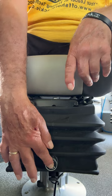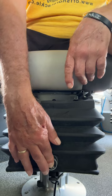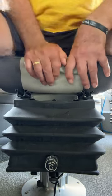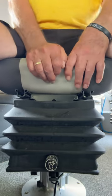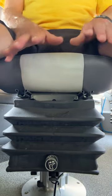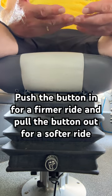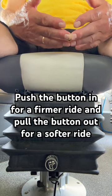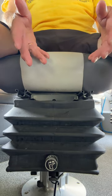This one is plugged into your cigarette lighter, and when I want to add air, watch this thing roll — it's got a little motor inside, takes you right up. I want to get it set so that I am not going all the way down, but when I hit a good wave, it'll take me down. We don't want to bottom out, we want it to suspend us, because if you don't have enough air in there, you're going to go all the way down, and it's going to be like not having a suspension on your boat.